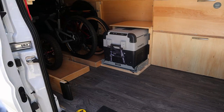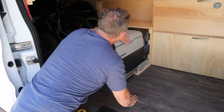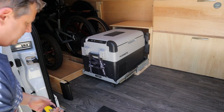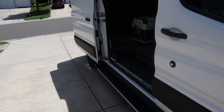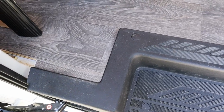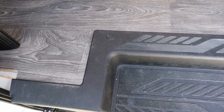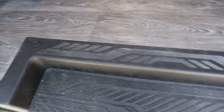Let's take some rough measurements. I'm going to slide this fridge out so I can open the door and see how much room we've got between the wall and the fridge. The battery ran out just when I was doing it, but I measured out 26 inches, which will give us about a 30-inch opening. I need to check what standard vanity widths are — I might go with a 24-inch, which will give me an extra inch or two of opening and a big enough sink.